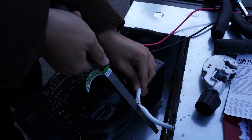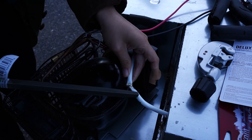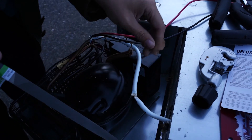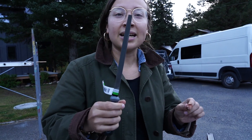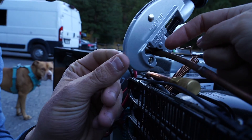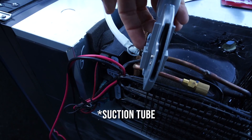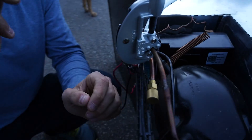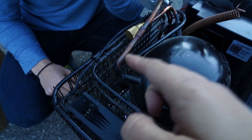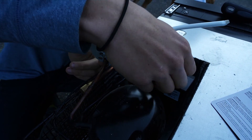This is a triangular metal file. There's a capillary tube inside this big white tube, and to cut the capillary tube instead of using a copper cutter, you file all around the outside and then snap it off. We're currently using the copper cutter to cut this copper tube as close to the painted area as possible. Unfortunately there's an elbow here, so we've had to support it as we make room for the copper cutter — it's sort of a four-hand job.